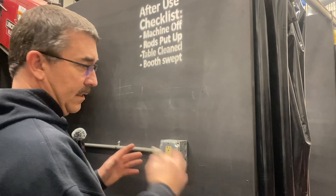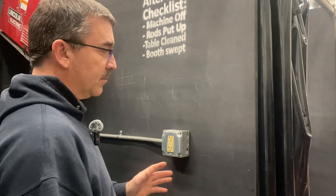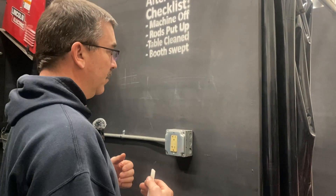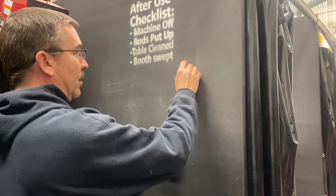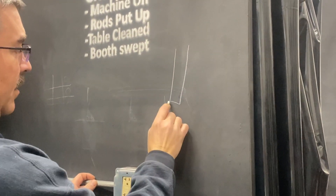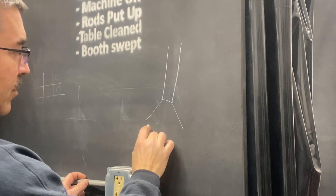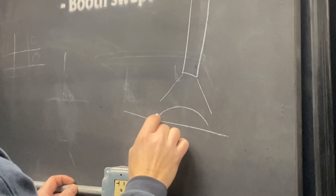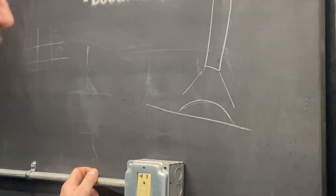There's a real in-depth technical side of how Arc Force works, but I'm going to give you the layman's terms the way I understood it best when it was explained to me. The softer the arc is — think of it like this: there's your rod and the arc is kind of fanning out a little wider, which makes your bead have a flatter, lower crown profile. That's the softer side of the arc.